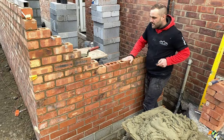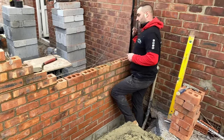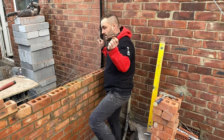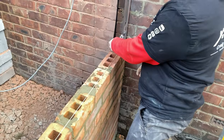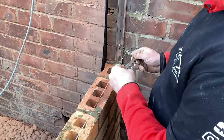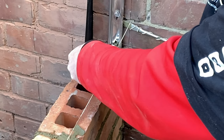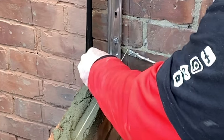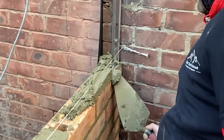All tie course here. So on every tie course, well on every three course on the starters, we put these, which I'll show you here. Have a look. So we just put them in the little grooves like I showed on an earlier video. Just slot in like that and that sits on top of the brick. Slide the tie down into the bed. Just like that,